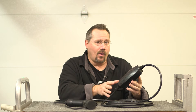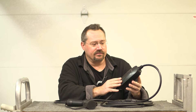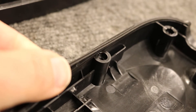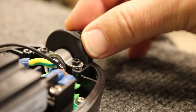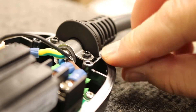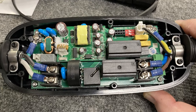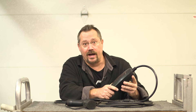Since I had the cover off, I also wanted to see what makes this weatherproof — what gives it that IP65 rating. I found that it actually has a very nice silicone gasket inside, one on either side, and the strain relief itself also acts as a gasket in the end. Inside everything looked great. The soldering was clean, terminals were tight, and in general it just looked like some very good electronics.